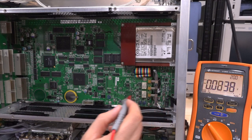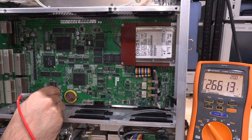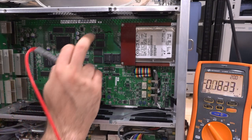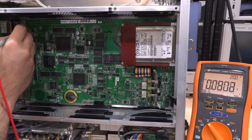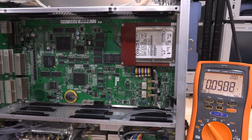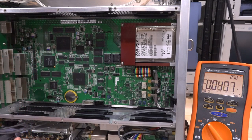The 3.3V backup voltage reads 2.6V - maybe the battery is a little low, but I wouldn't worry too much. The hard drive LED is also not blinking. Here is the 3.3V supply - it reads 0.4 volts. And a 5V supply reads 1.7 volts. Something is indeed going on with the power supply, and that's actually a good sign because it could be the easiest thing to fix.